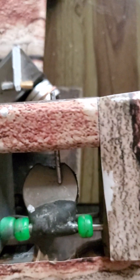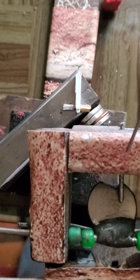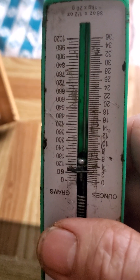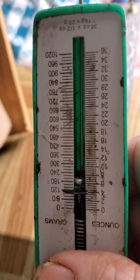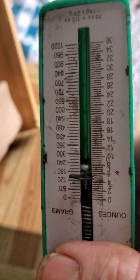The radius is about a quarter inch — that's just where the firing torque is. So I put a small mark on my flapper magnet, a quarter inch out from the axis. I want to put my ounce gauge there. Four, five — about five. About five ounces it takes to have it fire.